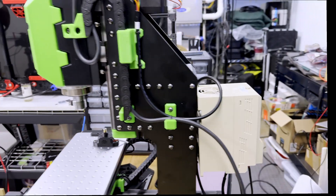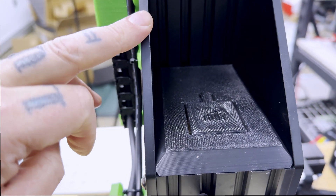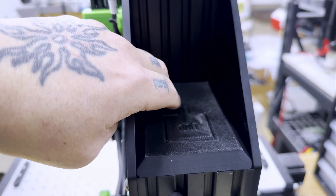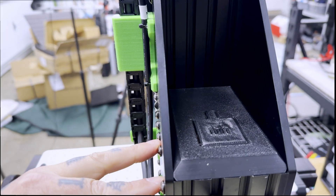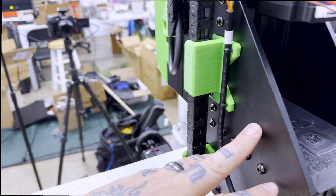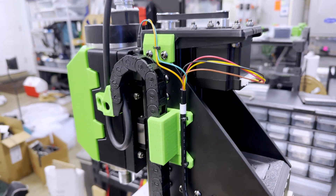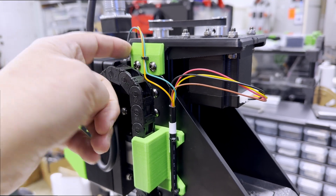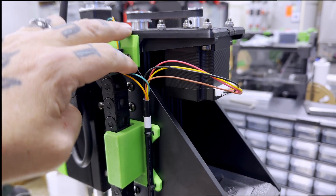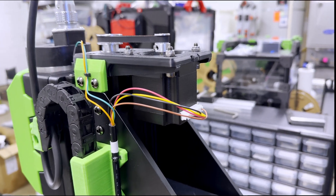Once you have those in place, I actually grabbed the one-two-three blocks that came with the kit to lay flat across the second extrusion, which gave me a point of reference to make it parallel with the two extrusions that go there. That makes it a flat surface for the ballast box and gets everything in place for you to install the 34 M5 roll-in nuts that have to go in there. Speaking of roll-ins, I would definitely preload the roll-ins for the printed piece that helps manage the Z end stop wires — it was a real pain to try and get roll-ins in there after everything was in place. I wound up grabbing some M5 T-nuts I had from another project.